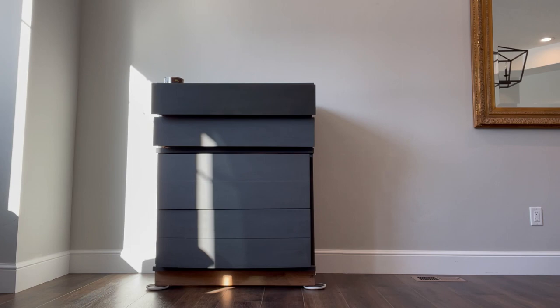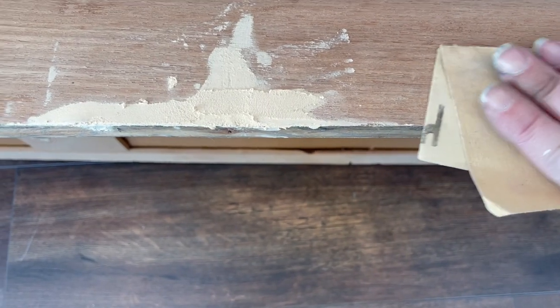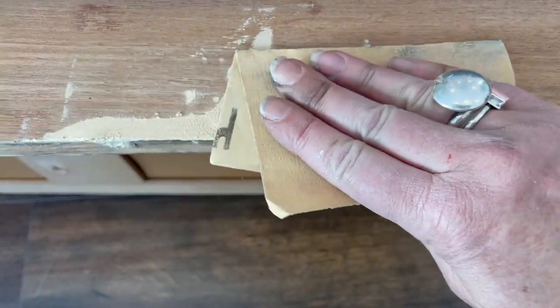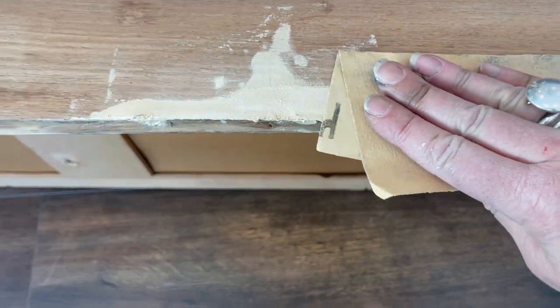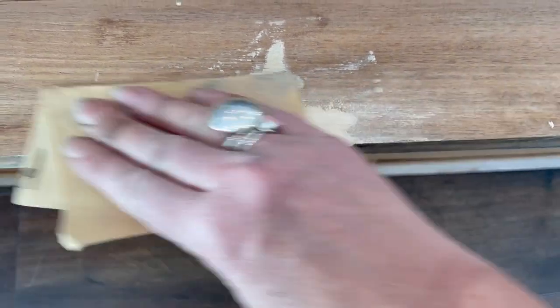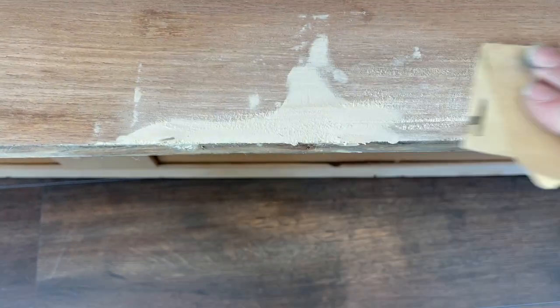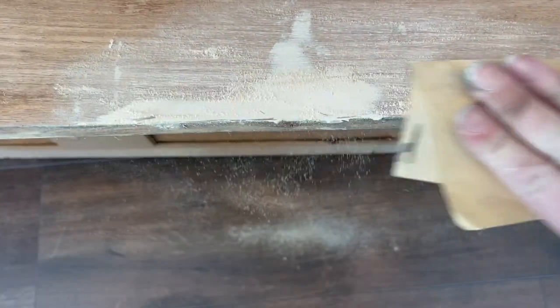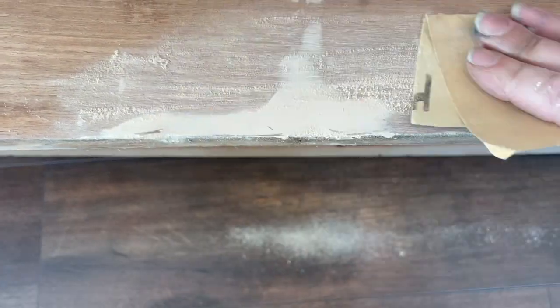We are almost done. I just need to add the hardware, but first the bottoms of these dressers, as I mentioned in the beginning, were in really rough shape. They were missing some of the veneer, they were chipped, they were peeling. So I filled in some wood putty that's paintable and also stainable. I sanded that down and then I found a cedar stain that was a similar color to the feet that I had purchased. And I stained that very gently and then added a polycrylic on top